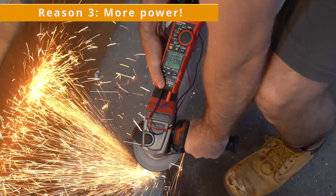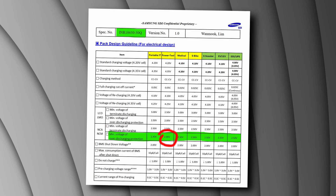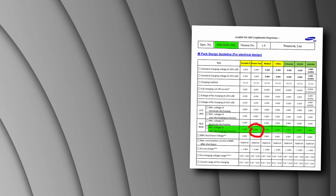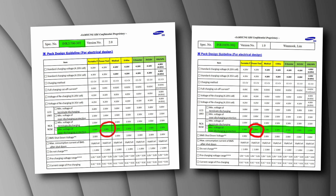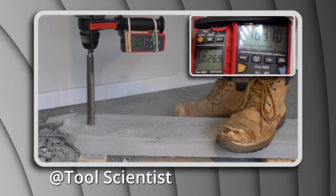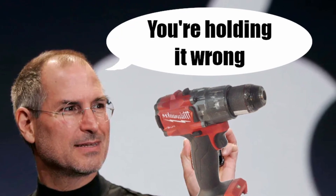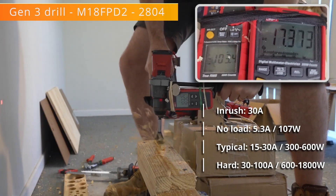I think it's being done to get more power out of the batteries. Lithium battery voltage sags under load due to their internal resistance, so very high currents can prematurely trigger the voltage cutoff. Some of Samsung's data sheets even specify 2 volts per cell as acceptable for power tools — though strangely I can only find this in the 30Q and 30T data sheets, which are cells that Milwaukee actually uses a 2.5 volt cutoff for. I think it's a bad implementation though; they should have used a variable cutoff voltage that factored in current. In my power testing video, most tools work around 20–30 amps, which is 10–15 amps per cell, closer to an electric scooter in terms of load.